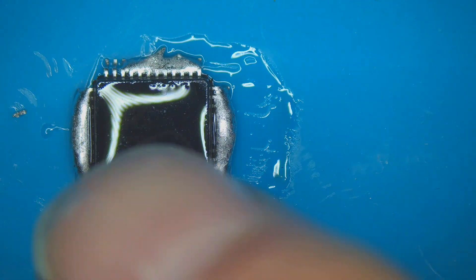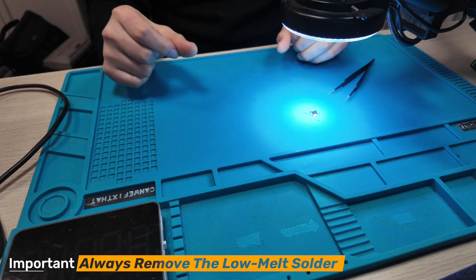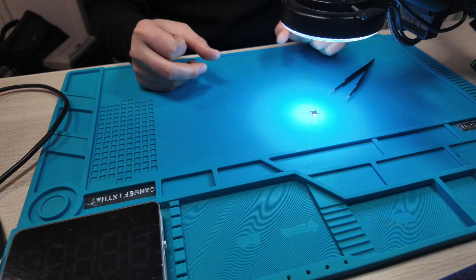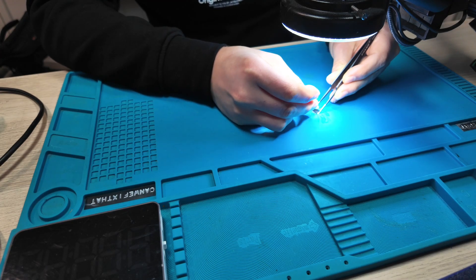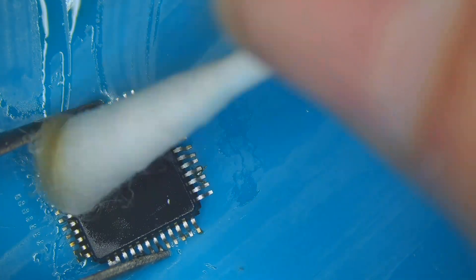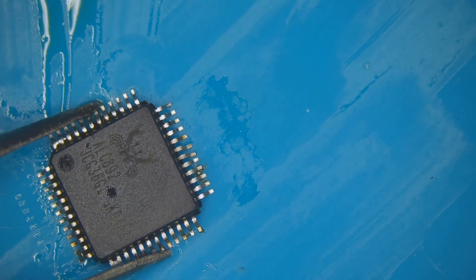What is important: you should always, when you want to reuse the chip, remove all the low melt solder, because it will get brittle over time. So don't think you can use it to solder the chip back in place with the low melt - that's not a good idea. It will get brittle over time and you'll have a dodgy connection. Use solder wick to remove it. The beauty of low melt solder is of course that you don't stress components much, because you use as little heat as possible. You don't need hot air, which would stress the board and nearby components much more.